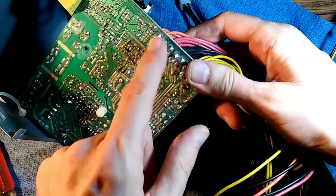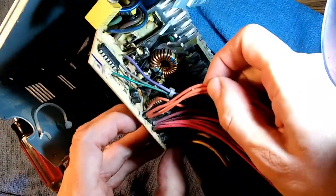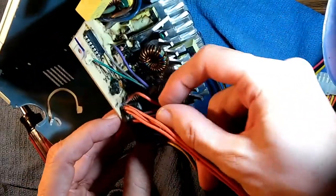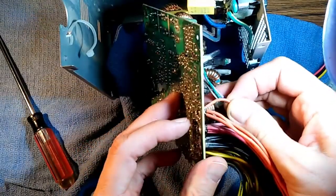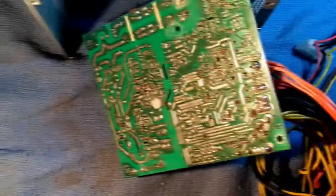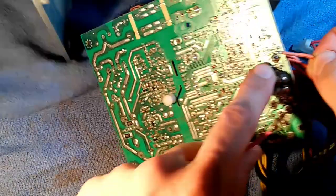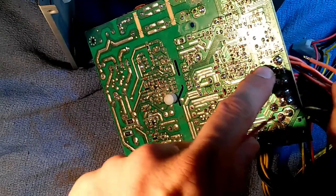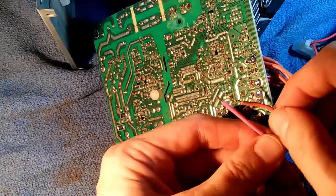We can get a better look at things. Here, this little pad is 3.3 volts. We have a whole cluster of wires coming into one hole and a single wire coming to this hole. I'll try to remove this wire and widen the hole with a drill bit so I can put two wires in. I've gone ahead and desoldered that orange wire from that point right there.